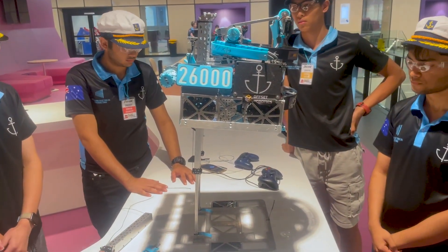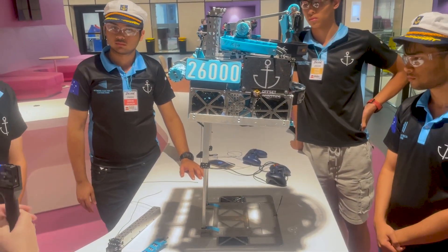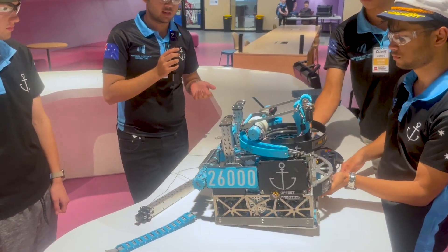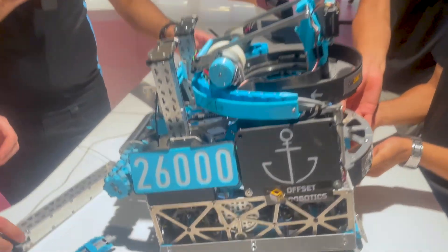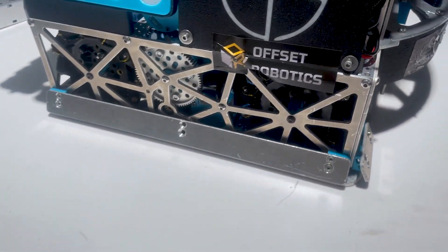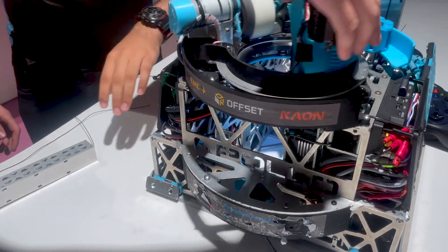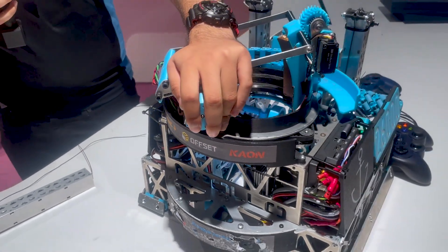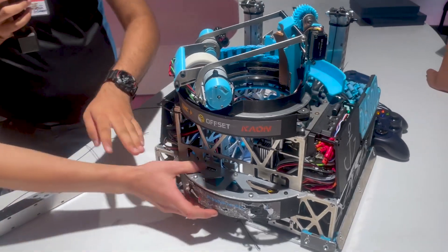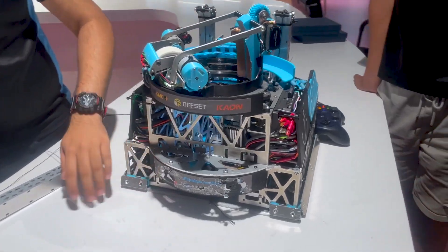I see there's a lot of protection around your side plates — how do you reduce the impact of other robots hitting your robot? We use defensive wedges that stop the main robot impact before it hits our actual plates, which if dented would cause a lot of problems. Additionally, for our turret cable management, we were really worried about other robots impacting us. Since the motor is going over the drivetrain, we added a guard at the front with a metal bash guard, which ensures that no robots can actually touch the turret and keeps everything safe. As you can see from our sponsor plate, it's very bashed up.